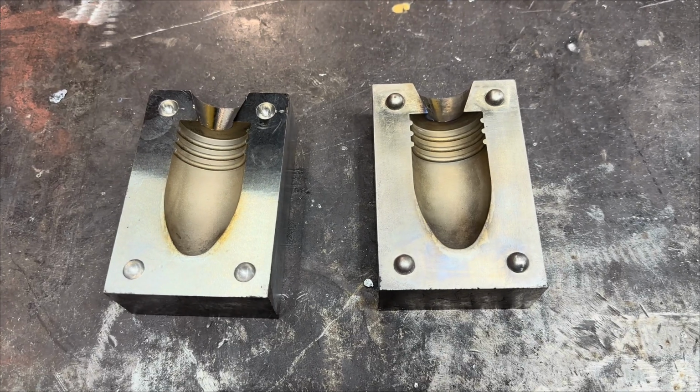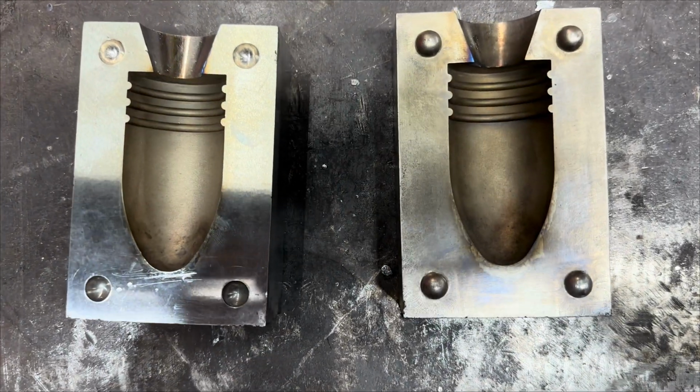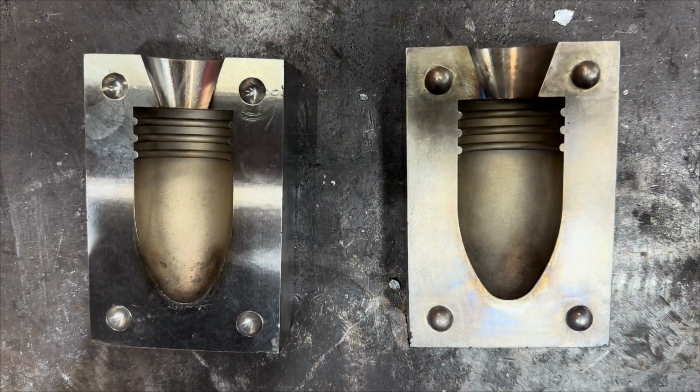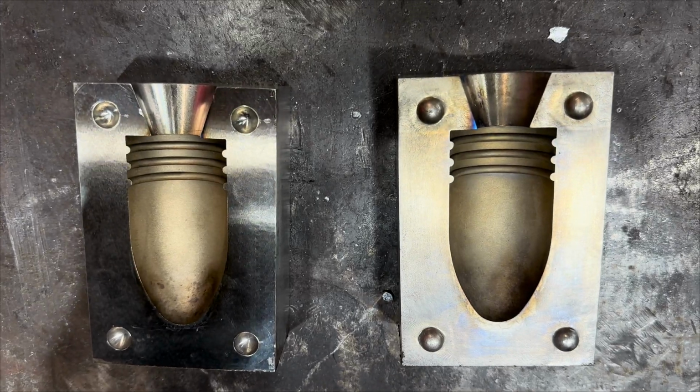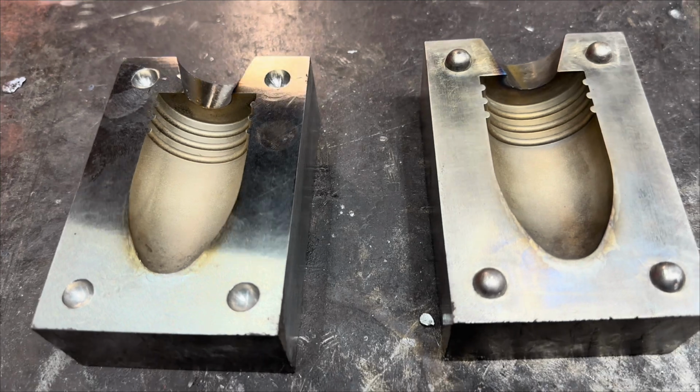So the first thing that you're going to need to make mini balls is a mini ball mold. This is the one that PCBWay made for us. It looks awesome. It throws some really great mini balls. So we'll take both of these halves and clamp them together, and then we'll preheat them for just a little bit. We use the stove top for this.